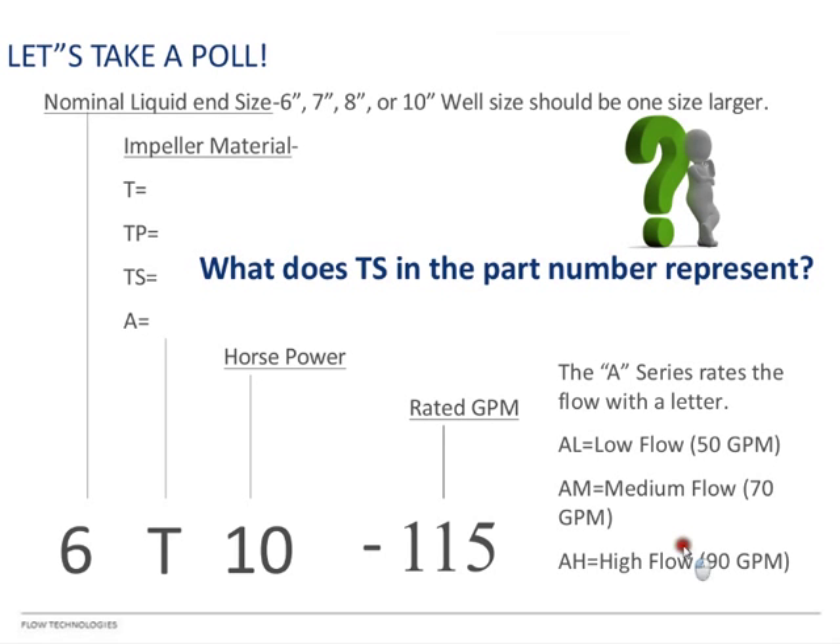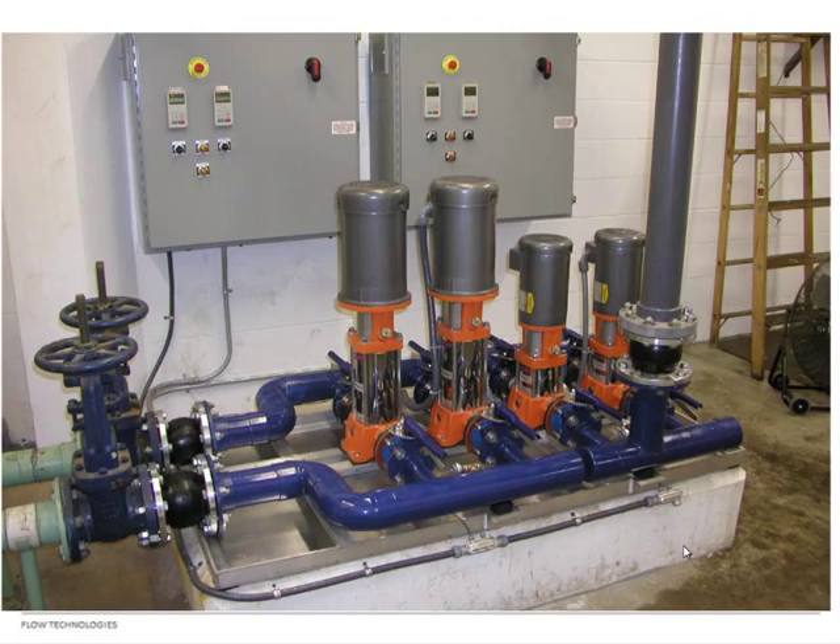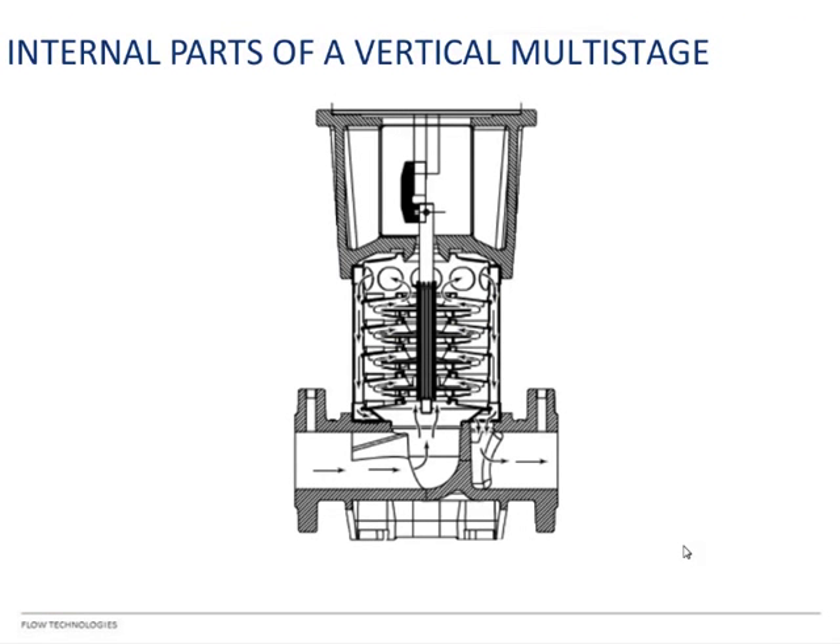Next, let's look at BVMs — Berkeley Vertical Multi-Stage pumps. In this case, BVM really does stand for Berkeley. The picture shows the pump without the motor — just the pump end. You can order just the pump end or the pump with a motor. The red lines I've drawn indicate the wetted ends — the parts between those lines actually touch the water. That becomes very important in a moment.